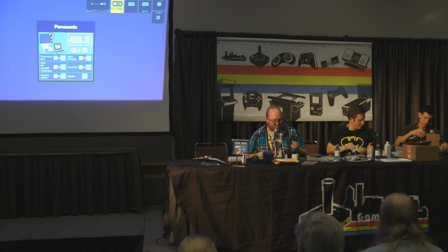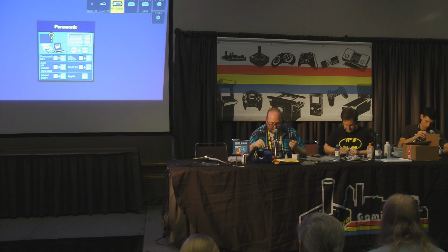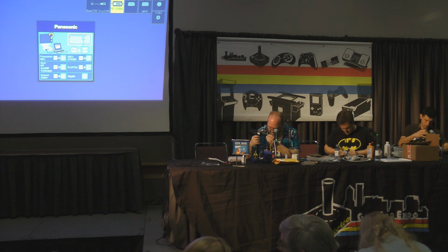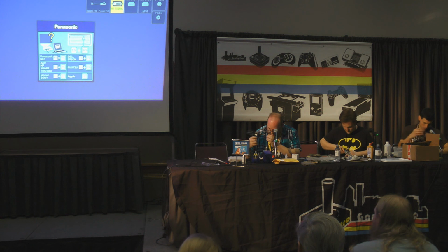I try not to use a screwdriver to shuck underneath the chips because you might scratch the board, and that's where all the traces are. These have EEPROMs, they're called the ROMs, but they have a ROM remover. You just chuck it in there and it pops up. They have other EEPROM removers too. I happened to grab that one first before I left, and I wish I would have brought the other one. They have one with little tweezers where you just pop to the side.